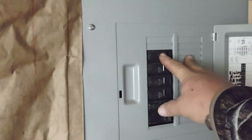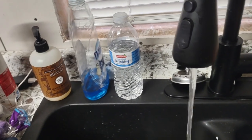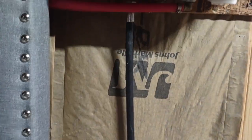We're going to go to the box, turn the water pump on, and then walk around outside and inside everywhere to check for leaks. There's the water pump — it's already pushing water. Turning it to the hot and cold to let it purge the air out. Let's make sure we're not leaking underneath the water heater — that looks good. Let's go to the shower — I'll try both sides, hot and cold. The way we know it's purged out is all of the air is gone.